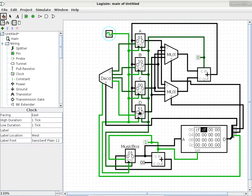Now this is the core of one of the most elemental instructions, which is really just saying, hey, I want to pick up these two registers, add them, and store the result into that register. That is one of the most basic instructions of any instruction set of any processor, okay? So what do you think would be the other types of instructions that you would need? Just in terms of concepts, we're not talking about specific opcodes. Copying. Copying, okay, very good. So copying is good. What else do you think would be useful instructions?